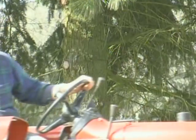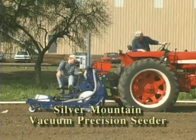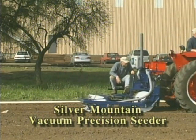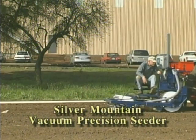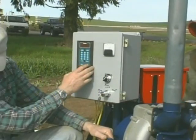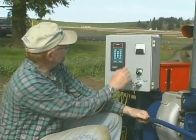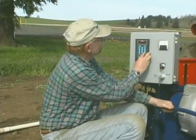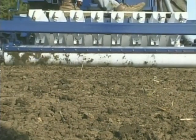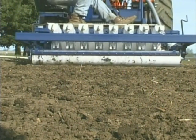Number one would be your planting equipment. Here we would look at Silver Mountain's Precision Seeder. This vacuum precision seeder is controlled by a computer which automatically spaces the seedlings to whatever desired distance the nurseryman would like. All that's necessary is to enter into the computer the number of seeds that the nurseryman wishes to sow per foot per single row, and the computer will do the rest.